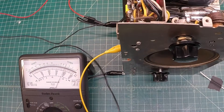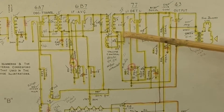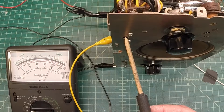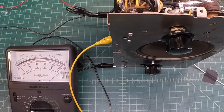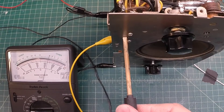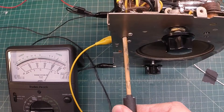Let's move along here to the second IF. Up next we'll adjust C10 and C11 right here — the second IF. We'll start with C10. C10 is located right here, and C11 here. You can see I should be able to peak now at this location.